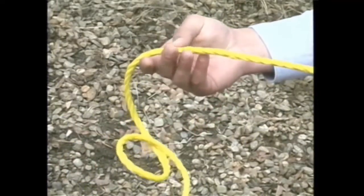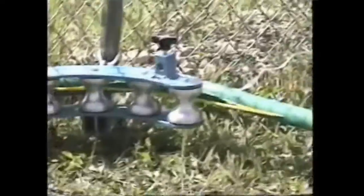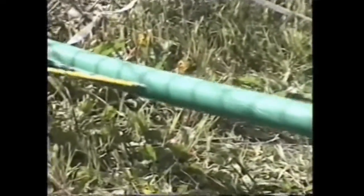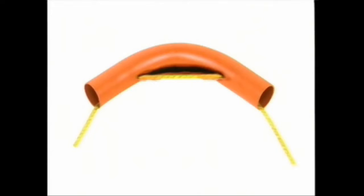Next, the 3/8-inch poly rope was tested using the same equipment and identical parameters. You can hear the difference immediately. As the rope surges, it actually saws through the plastic conduit. That's because the rope elongates as the cable resistance increases, and the resulting friction is concentrated at various contact points throughout the pull, due to the rope's round construction. Nowhere is this more apparent than at the sharp bends in the duct, where the surging rope burns through the conduit in seconds.